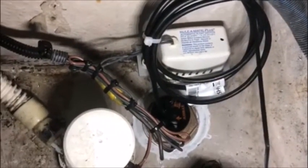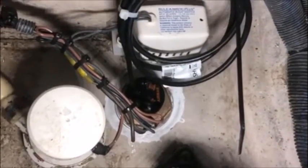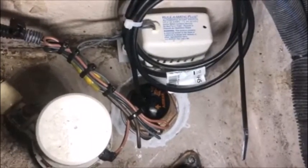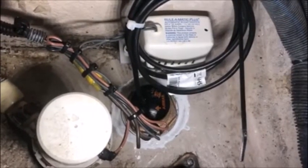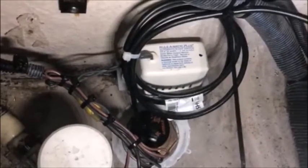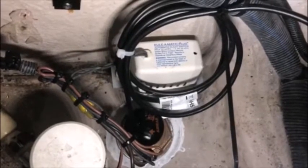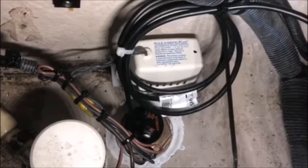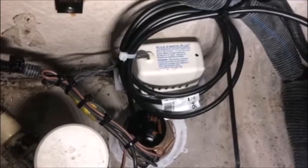George Shively back with you here in the hull on the 48 cockpit motor yacht. As you can see now, there's a new transducer in place. You'll see this little bit of extra wire here — you still have to cut that wire tie. Always cut them to length. But you'll notice now that if you look carefully down there, you can see that the arrow is pointing towards the keel, which is the way it's supposed to be — not pointing forward, but pointing towards the keel. The reason for the extra wire is that it's called a service loop. If you ever have to drop the transducer for whatever reason, you've got a little bit of extra wire to work with so you can easily service it. Hence, service loop.